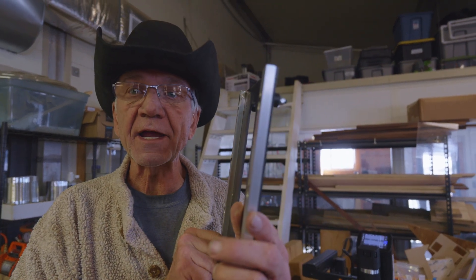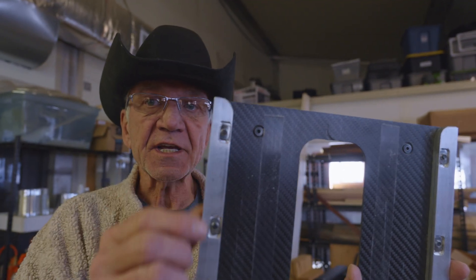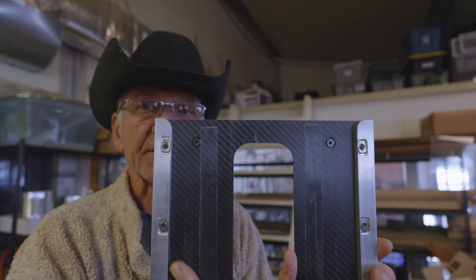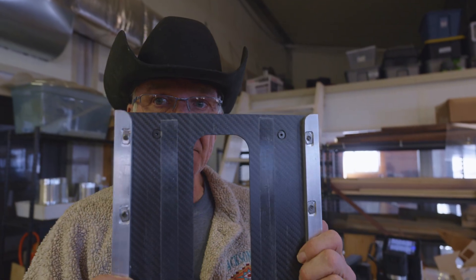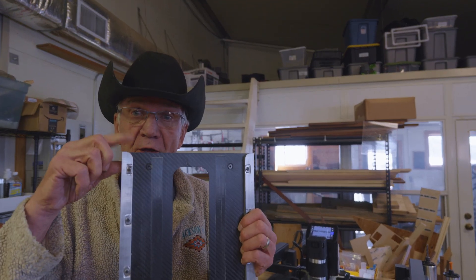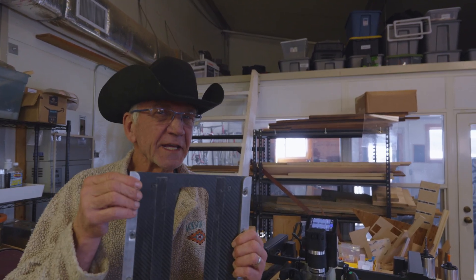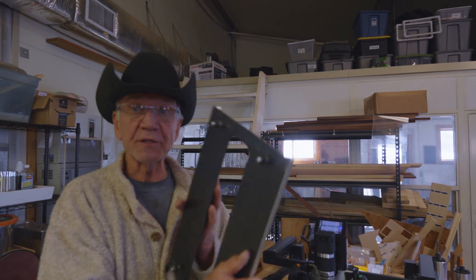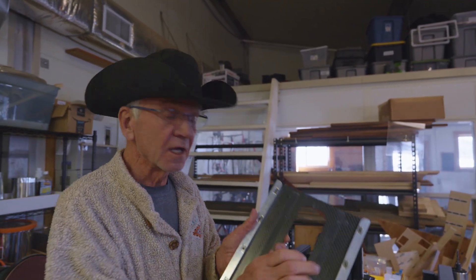The original Z sled had 20 by 20 millimeter rails on the side — those were too tall and also too narrow once you add the BenchPilot bracket to the Shaper Origin. So I milled new rails out of three-eighths by three-quarter inch aluminum bar stock. The holes are milled off-center to give more room side-to-side to fit the bracket. The Shaper Hub project has the files for milling these replacement aluminum rails. If I were starting from scratch without an existing Z sled, I probably would have made the carbon fiber sheet a little wider and used three-eighths by three-quarter T-slot extrusion instead.